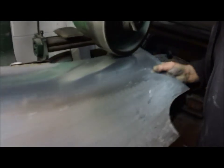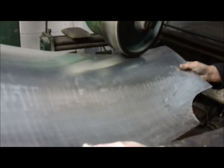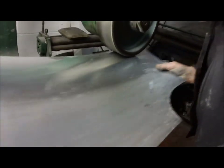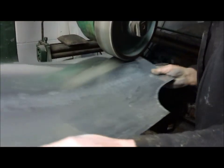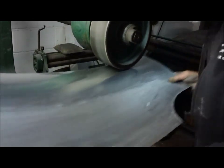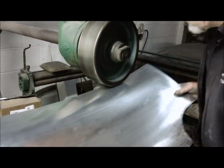So what you're doing now is to get that front corner down — to drop it. So we're going to stretch that outer edge. And you're applying more pressure to the outer edge. I'm going to wheel more on the outside edge, run that out next to the edge. Put more wheeling right on that edge where you want it.